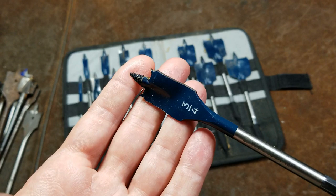The big disadvantage is that since they have a real short cutting area — both in width and in length — they do have the ability to wander. Even with ones like this, which have a screw tip to help pull them through the material, if you're leaning off to one side or the other, it will start to make a not particularly straight hole.